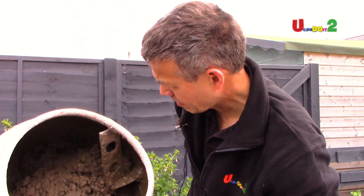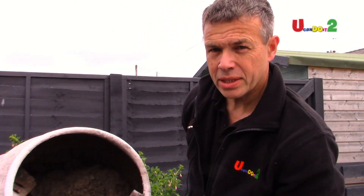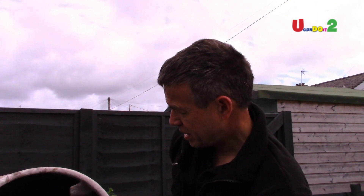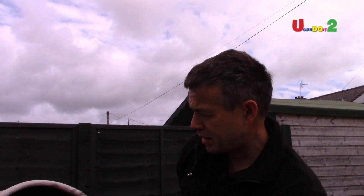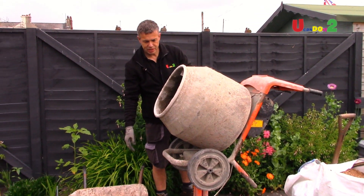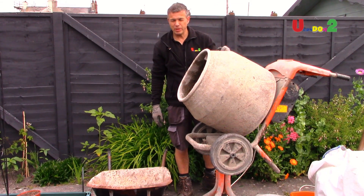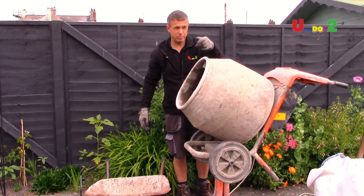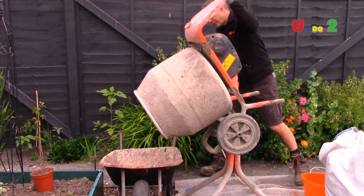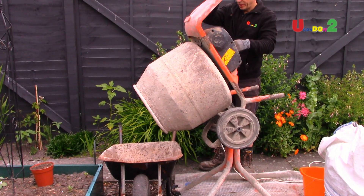Just enough. That's a good mix. It's coming away from the back — you can see the back of the mixer. You can see there's no colour from sand or cement there; it's all well mixed. So I'm going to tip it out into this barrow now. You can tip it out while it's mixing, but it does tend to spray everywhere. So I prefer to tip it up — I know it's going to be in the right place. And then you can give it a whirl.